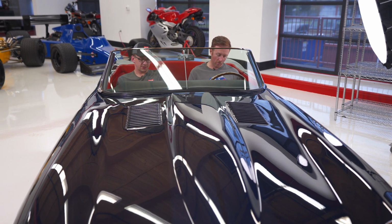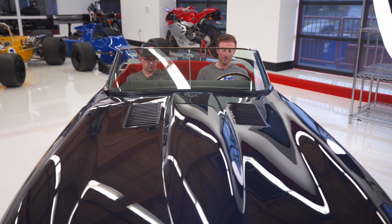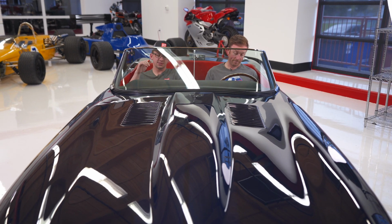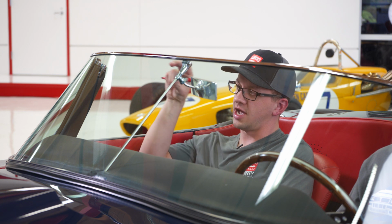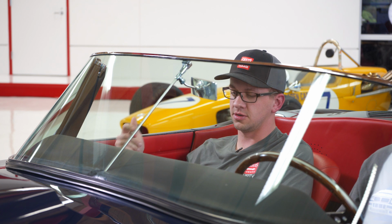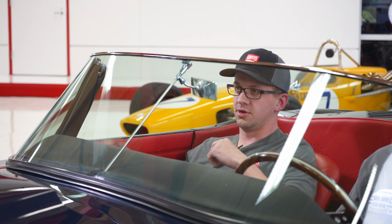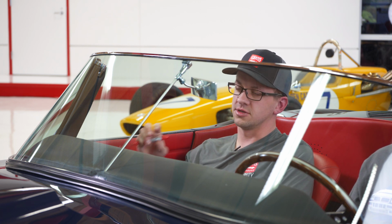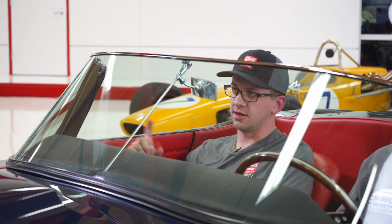All right. So Clifford Wirtz. What is the definition of throw with respect to orbital polishers? You want to take this? Or you want me to? Sure. So it's the distance that the counterbalance and the backing plate is traveling in an orbit, essentially. So the diameter of that orbit. So the G15 features a 15 millimeter orbit. The G21 features a 21 millimeter. The G9 is a 9 millimeter, and so on. So the numbers in all of our tools correspond to the diameter of that orbit.